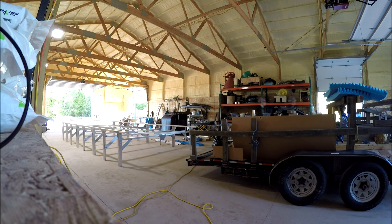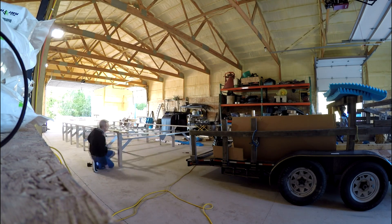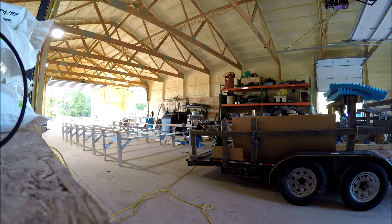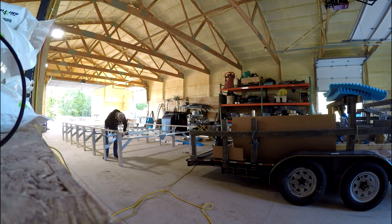When I was putting up the first rib and the first rail rests for the x-axis, I put it on at the first rib on the L bracket, which helped me stabilize the first rib. The second rib then allowed me to make sure the entire assembly would be pretty stable while putting it together.